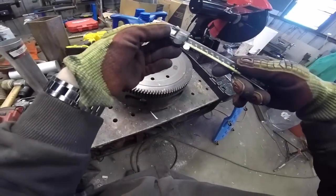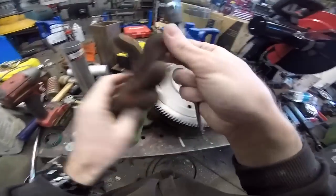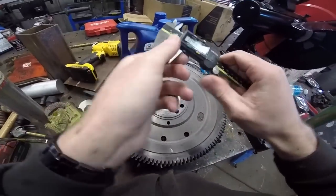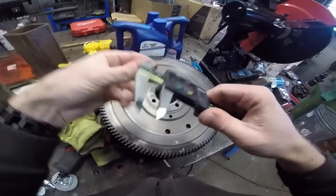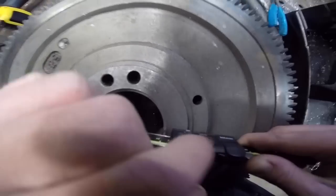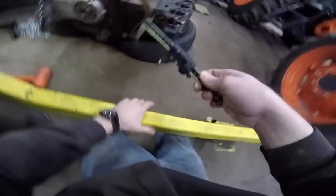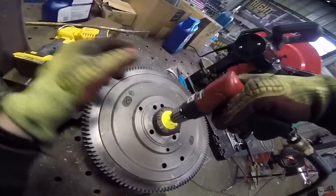I don't normally Black Friday shop, but I did recently and got a genuine Mitutoyo digital caliper — only 30 bucks on eBay. Kidding — I bought it from a real machine supply. That's as wide as it gets right there where I zeroed it. What's great about these digital ones is you can zero them on whatever number you're targeting. Still need to remove five thousandths — all that sanding only took off two thousandths. And this thing is like two inches too big to fit on my lathe.